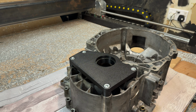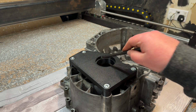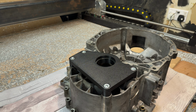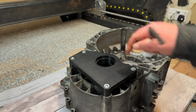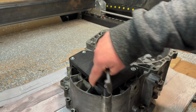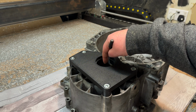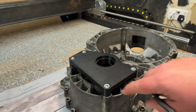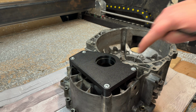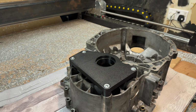Right, for the next video, what I think I'm going to do is do a complete rundown of how I set things up in Fusion, setting the stock size, selecting the stock, the CAM, toolpath, operations, all the considerations I've got with this, because obviously it's going to need machining on both sides. So I'll go over on a part like this where I haven't got a sort of right angle. What I'm going to have to do is probe on this circle and then either align this to my X gantry so it's parallel, or I'm going to use that as the center and then use IO sender, which is the control software for the machine. I can actually probe off 2 points on here and it knows what angle that is on the workpiece. So either way, we've got a few things to go through.